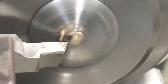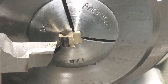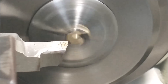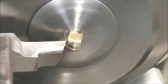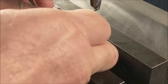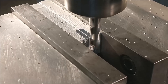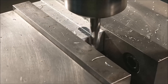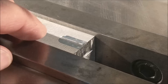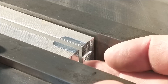A sharpie marker is always good to assist with visibility. A couple of facing passes and you're ready to go. The very last operation before this part is considered complete is to radius the last corner. This is a very delicate part right now and easily damaged by the pressure that a vise can deliver. I'm going to make a pair of aluminum jaws with a square-cut corner as a vertical reference — you'll see how I line it up in a second.